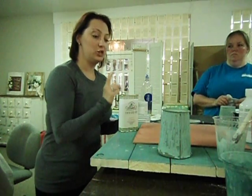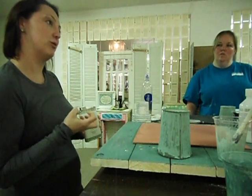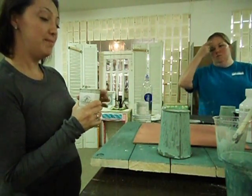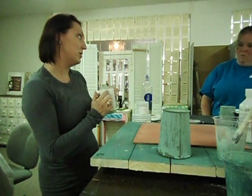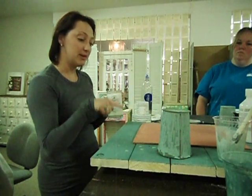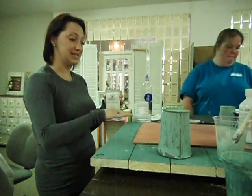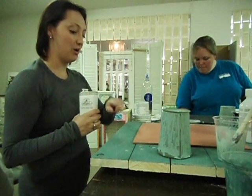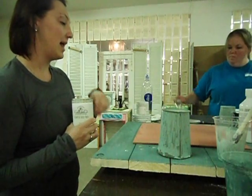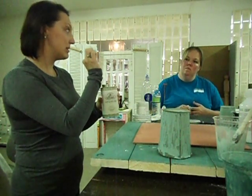So now, if you want to get the chippy look on something and we're working with this raw porous wood, you should not be able to get it with something that is porous — this is just going to soak up the milk paint. So what I like to do: I take a little bit of hemp oil. On a piece that is this raw and wanting to soak in a lot, you might put two thin layers of this oil on. Let it sit for an hour or two if you can, then put the milk paint on. And in those areas where you put this oil, you're going to get that chipping and flaking — because you've created a resistant area to that milk paint penetrating through. One coat will work; two coats is better on a very porous surface. If you've got something that has been previously coated and you just want to make sure you're for sure going to get the chippy look, just take a very thin amount of hemp oil and apply it in the areas where you want to see the chipping, and you're going to be guaranteed that it's going to fall off those areas.